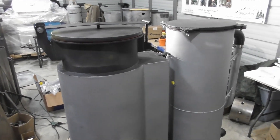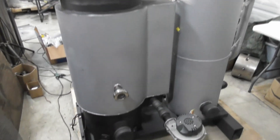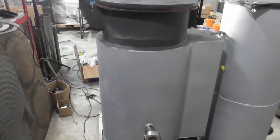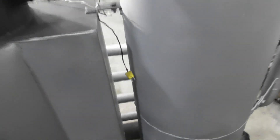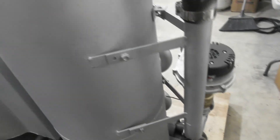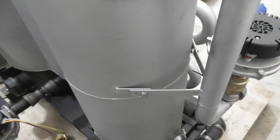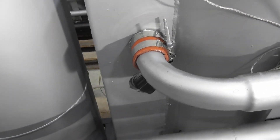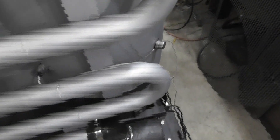Welcome back. We've pretty well finished up our build. We've got all the sub-assemblies connected and leak tested. You can see we've got it put together here. I've got the paint touched up on it. We've got it wired up for the thermocouple — we've just got to plug it into the display. You can see here we've got all our tabs welded on, all of our silicone hoses connected and tightened up.